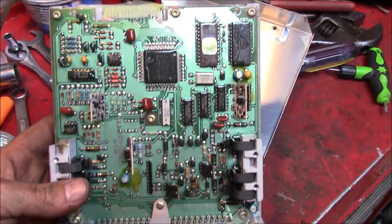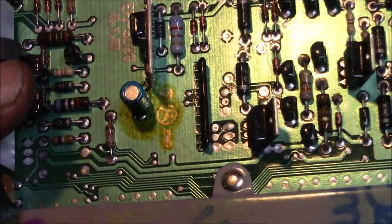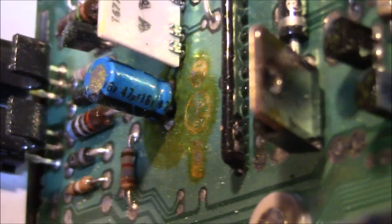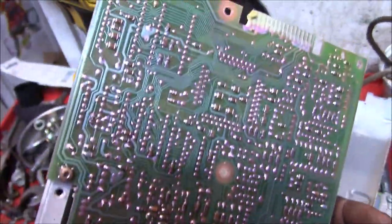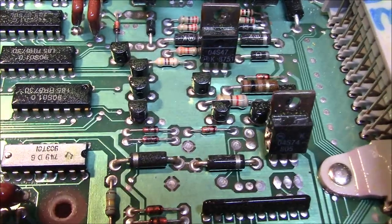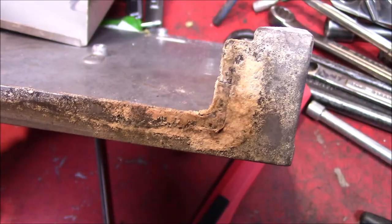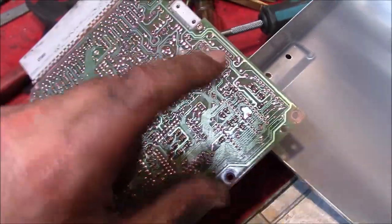They're really pretty cheap on RockAuto, but this one's just sitting here so let's tear into it. Breaking the seal — oh man, I just extended the warranty on that truck. There's the circuit board, and looking closely there's some staining right around the capacitor — also some around that one and one more down there, though it doesn't appear to be leaking. Decode the capacitors, go around to the back, find where they are, unsolder, and put some new ones in. Good chance it'll be as good as rebuilt.